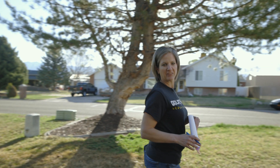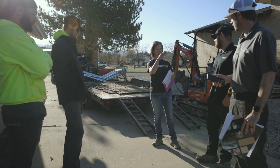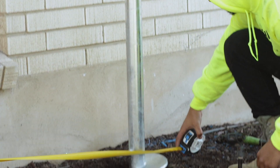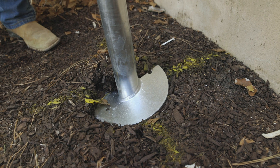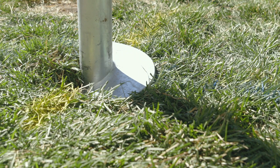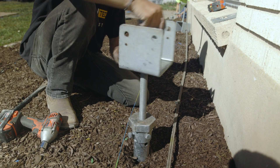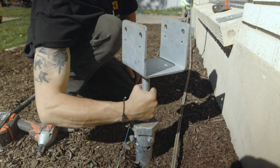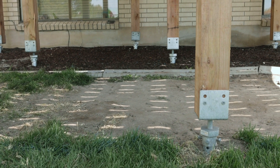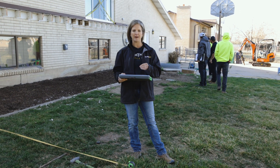Now we're going to go ahead and lay out the deck. Let's go to the backyard and get it set up. We have installed helical piles for deck footings for contractors to build over 2,000 decks in the last five years. Using helical piles, our contractors have the option to build year-round because we can penetrate frozen ground and install footings for decks using helical piles below the frost line. We can alleviate the pain of digging and pouring the footings in summer too. It is a game changer. Deck season is now 12 months instead of April to November. Turnaround time for each job is significantly reduced. We let you do what you do best — build. We do what we do best — drill.